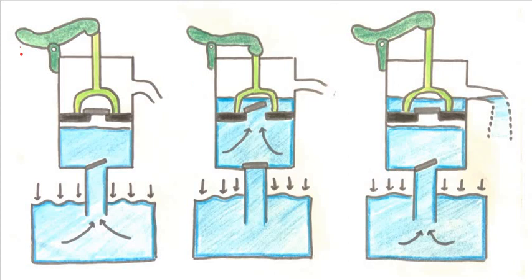This is step 1 on the summary slide. Handle goes down, piston goes up. In the lower chamber, volume increases and air pressure inside decreases. The air pressure outside is comparatively more, it pushes the water down, and the water in turn pushes valve B open. Valve A stays closed and water eventually starts gathering in the lower chamber.